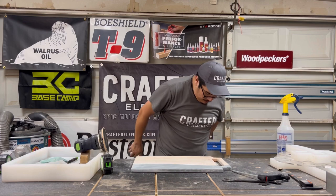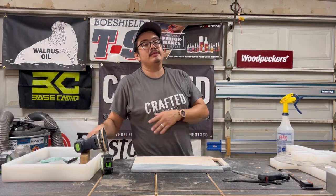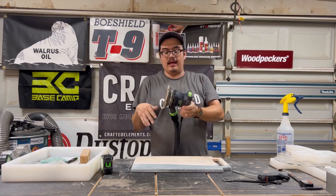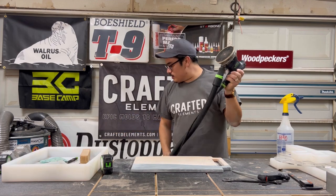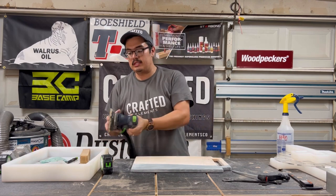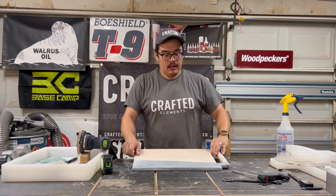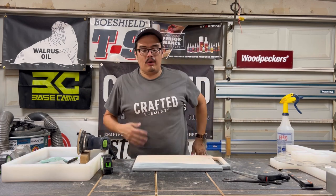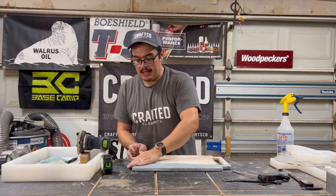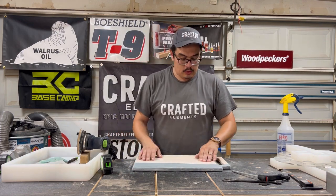Y'all, so now that we are officially covered in stuff, not a whole lot. The reason I don't use a mask is because I have my ETS 125 hooked up to a Festool CT15, which eliminates most dust. Really, that stuff was just what was left on the board and got on my hands, and that I've been wiping. So that's why I'm not too worried about masks or anything like that. But in other instances, I do use my mask.